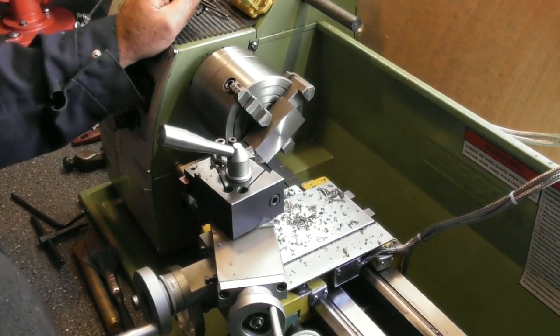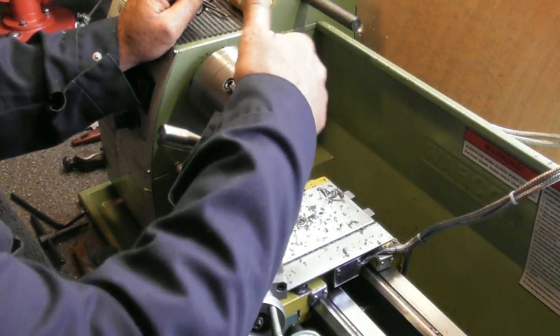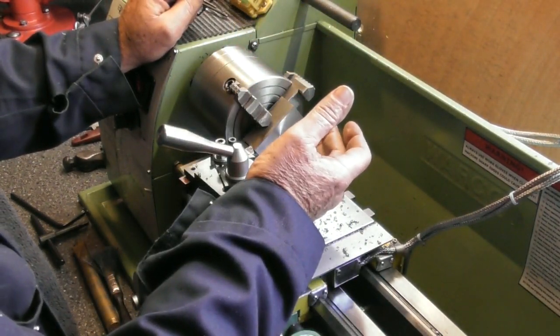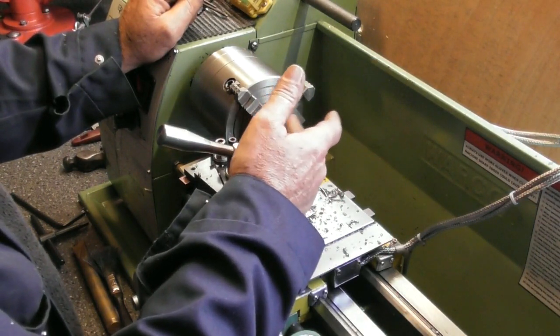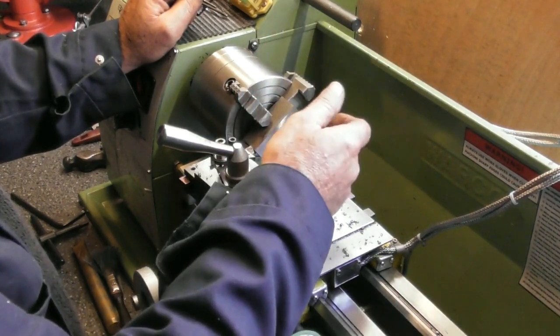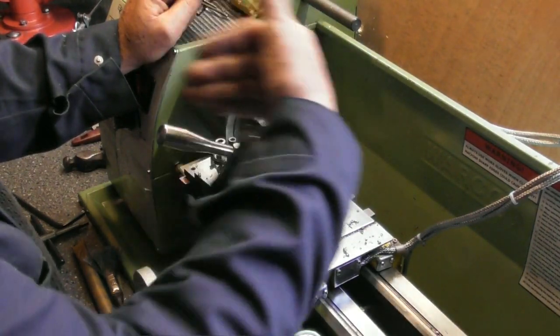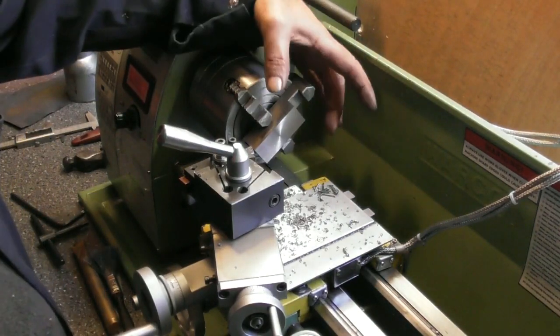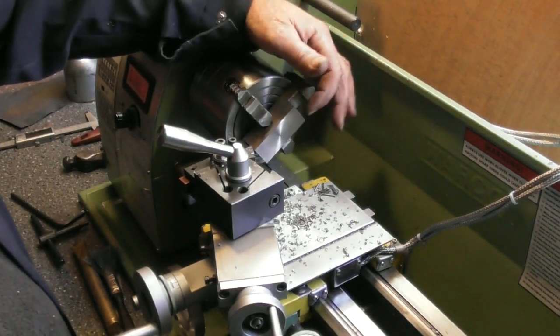So I'll flick it round now. Machine the other face exactly opposite to a size. Clean up, and I'll probably go 0.1 under clean up. It should work out the same both ways. Set a 0 as to where that second cut was, and I'll do the same when I come to do the other 2 faces, the same finishing cut, so that my block stays square.